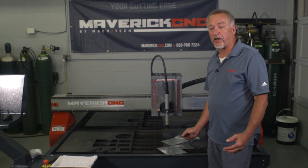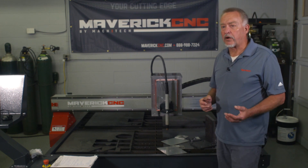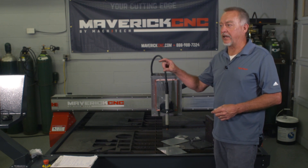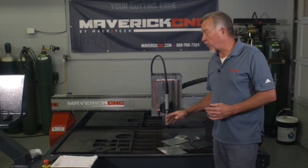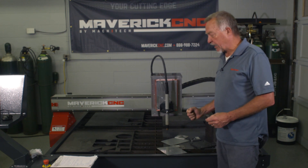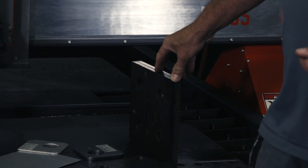One of the other questions asked quite often is: can my machine really cut that one inch steel? Contrary to popular belief, it's actually easier to get a good cut on thicker material than on thin material. The reason is the plasma is a really powerful, very hot arc. To get the best cut on thin material, it has to travel very fast, and that's difficult for the machine — there's a lot of weight that has to move to move the torch around. Cutting at 350 inches per minute is harder than the 18 to 25 inches per minute you might do on one inch material.